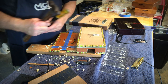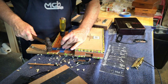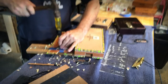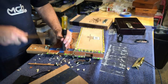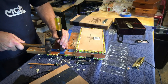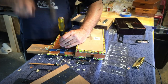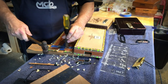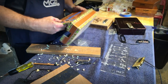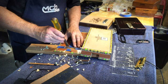Now I've drilled the two holes on the ends. What I like to do — and I've demonstrated this in other videos — is use a chisel, which is usually good enough to get through. I'm going to take the chisel and go down the lines that I marked. It's kind of a little bit rough, but it will work. I haven't quite got through, so I'm going to go a little bit more. It did a pretty good job of cutting through; I see one area that's sticking out a little bit that I want to trim off.